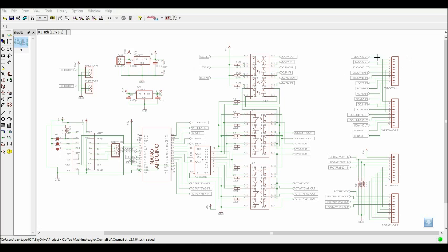From my controller board, though, I can monitor when buttons are pressed for some additional functionality, which I'll share later, as well as I can induce a button press from the controller perspective, i.e. from a command on the web app via the USB. And similarly, the idea is to also read the data that is sent to the display, read that into the Arduino, and then potentially put that same display onto the web app, so that the actual machine and the web app remain in sync at all times.